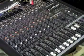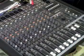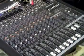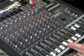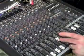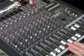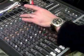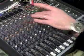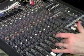The normal rule of thumb when using auxiliary sends is you want to send the signal pre-fader, and what that means is send it out of the desk before it gets to here and this fader level, because basically when you're messing about with all these sliders, you don't want that to interfere with all the levels for your monitor mix. You want to do your monitor mix levels with these red dials here. So you want to take the signal out to the monitors before it gets to the fader, pre-fader.